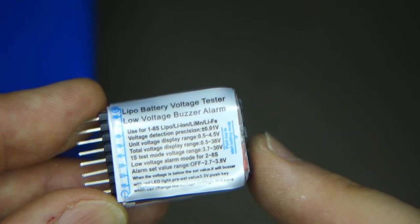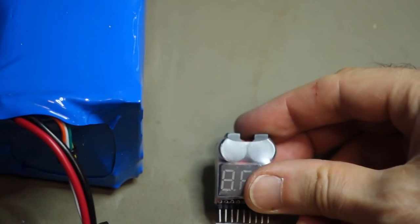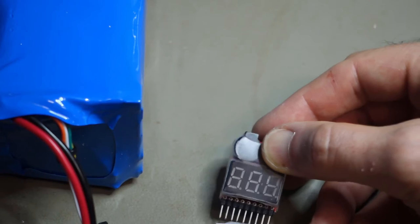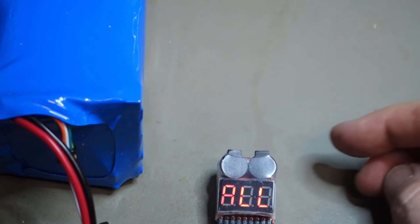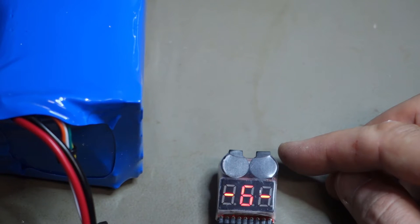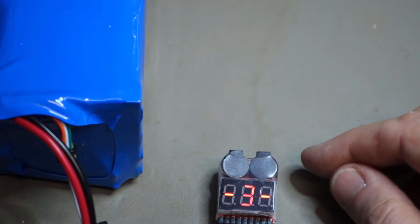Anyway, I'll just further demonstrate that. I think it was a bit clumsily done when I first did it with the battery, so I'll just do it again here. As I say, I've gone through all five, and I've actually picked this is the best one. So 23.5 volts, 391, 394, 388, 394, 385, 390. Okay, so between 385 and 394, going to just spread around about a tenth of a volt there.